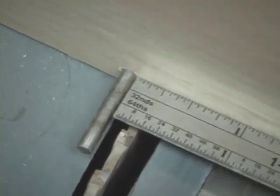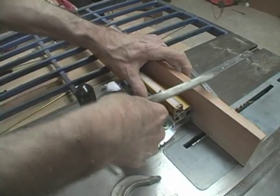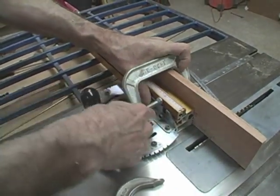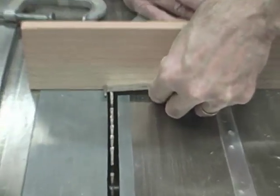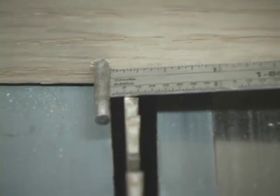So what I'm going to do is line that up. The saw kerf is one-eighth of an inch, the drill bit is one-eighth of an inch, and the space between should be one-eighth of an inch. I'll clamp that firmly in place to the miter gauge. It's always easy to get things a little bit off, and it doesn't look like I did too bad of a job.